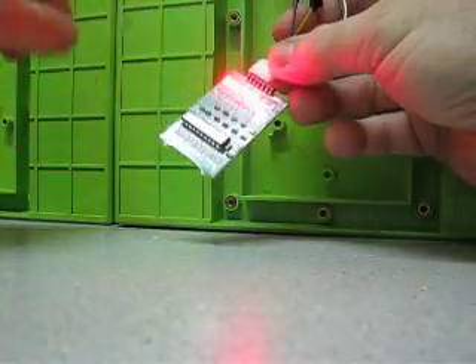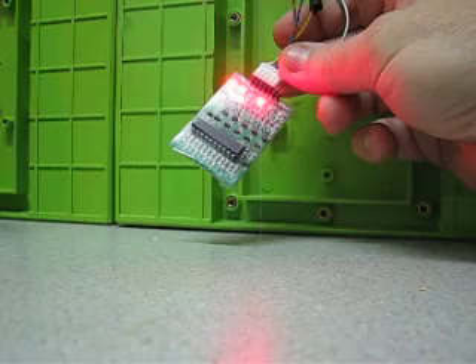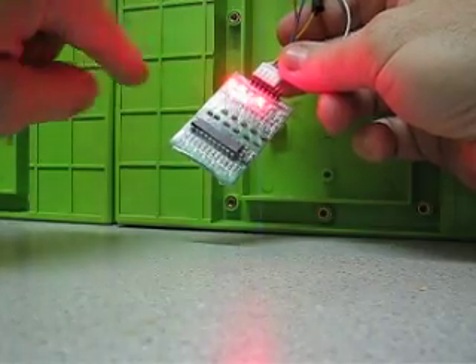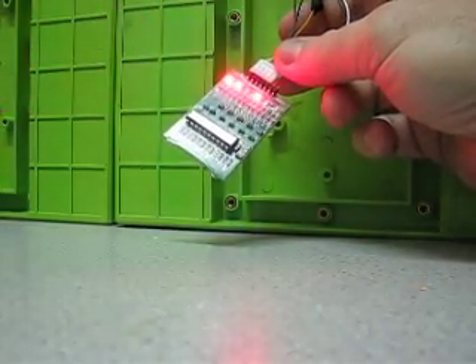So I found these. This is registering all the cells that are good to go for a charge, and now it's bleeding off the cells that are almost charged. What it's trying to do is bleed the three highest cells down to the lowest cell to balance it.